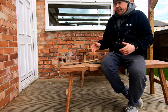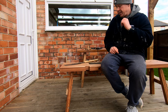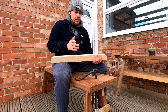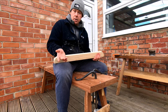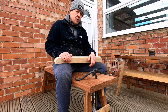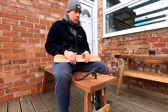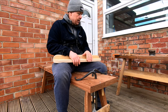I've actually re-sawn boards at about 200 millimeters, 170 millimeters in that region — that works quite well for that. Something I forgot to mention: when this is in the notch, it's really good for end grain planing. If I had maybe two or three boards glued together, which is quite common for me — like if I was making a dovetail blanket chest — that's going to hold it. I think if it was about three boards I don't even think I would have to wedge it up. I haven't had a chance to fully try that out, but I think it's going to work really well from the few experiments I've done.